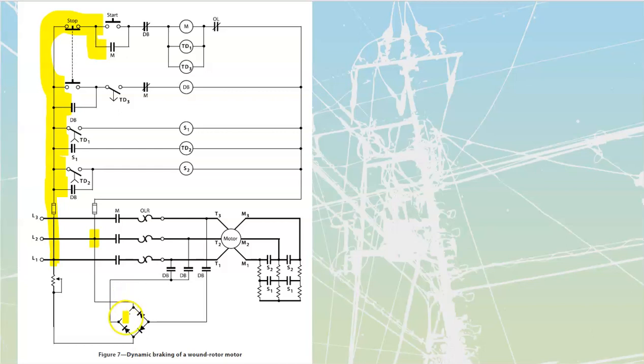I also note that I'm going to have power fed from there into here and from there into here. We're going to provide a constant voltage into this bridge rectifier. The bridge rectifier is not going to dissipate any power. This one over here is going to pass through any positives, making this my positive lead. This over here is going to pass through any negatives, making that one my negative lead. But there's no current flowing through there, so I don't have any dissipation happening off of it.